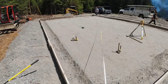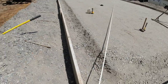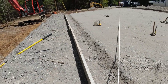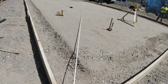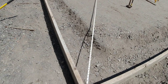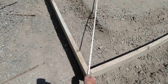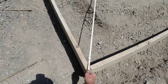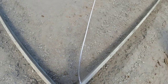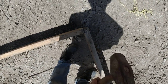We're getting our square now by measuring our diagonals - we want to get the exact same measurement diagonal to diagonal. That's how we square things. We've never had a problem with something being out of square doing it this way, as long as we're careful pulling the tape the same both ways, getting our corners right where they need to be, and then pinning the corners so they don't move. If it's not perfectly square - this one was out about two inches when we first measured it - all you have to do is slide the form half the distance it's out. If it's out two inches, slide it one inch one way or the other, and that gets you where you need to be.